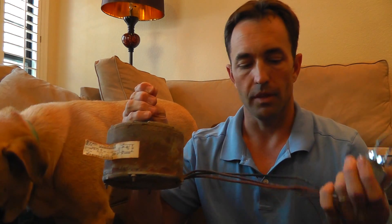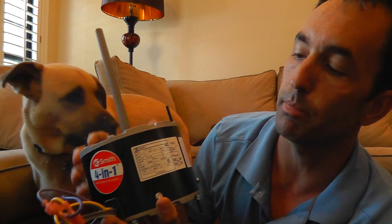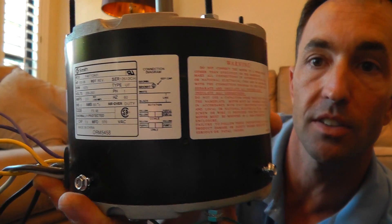So now your wire — you pull the old motor off, you got the blade off, hopefully in one piece and intact. You got your three wires taken off. Remember where those two power wires went — that's very important because on your new motor you're going to have four wires. The key on your new motor is look at the schematic. Each motor has a little schematic right there on the side. It's going to tell you some information about that motor and how it's supposed to be wired. Don't get hung up on colors. This one says brown and brown-and-white to a separate capacitor — into the terminal strap. Done. That's two of your wires down.